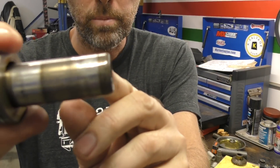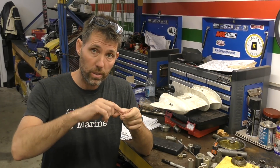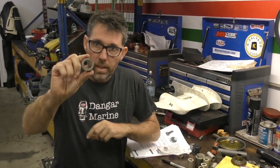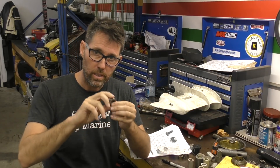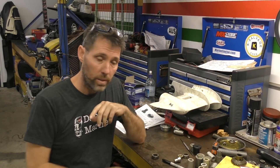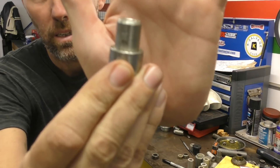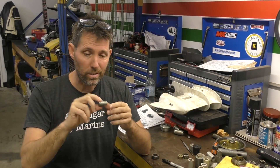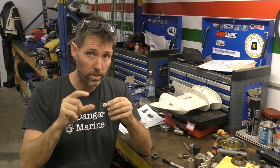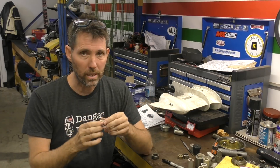We can also see that only about this much of the pinion gear is supposed to pop up from that top bearing, and eyeballing it, it actually looks like it's running in a pretty good position. Next thing we're going to install is the drive shaft bearing, which goes in a housing above the two pinion gear bearings. This is the drive shaft bearing we'll be installing, and this is the bearing housing — we need to put the bearing into the housing first, then the housing into the gearbox. I'm going to oil this first. I'm going to use this little attachment which came in the Evinrude kit — essentially this shape. If you want to make a tool like this, all you really need is a bit of solid round bar slightly smaller than the outside diameter of the bearing, with the end machined down so it's slightly smaller than the inside diameter. Not hard to make — if you can go to a machinist, they'll be able to make one up for you.